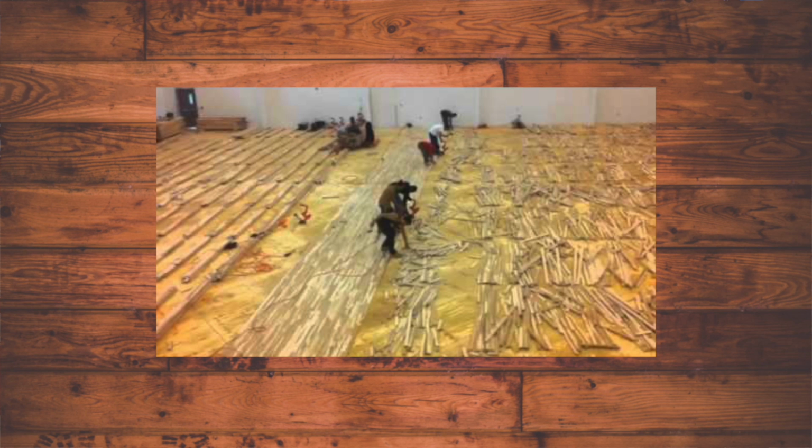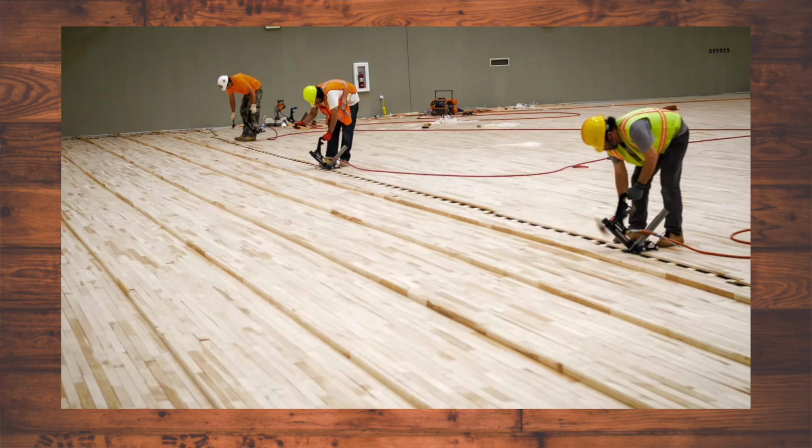In my opinion, the typical way it's done is that you have 3 or 4 or 5 guys on a line, and they are all nailing anywhere between 20 and 30 feet. My observation is that every nailer has a slightly different swing with that hammer. What happens after a while is that line tends to get waves in it. By having one nailer go the whole length, although it's more walking for the guys, and I recognize that.